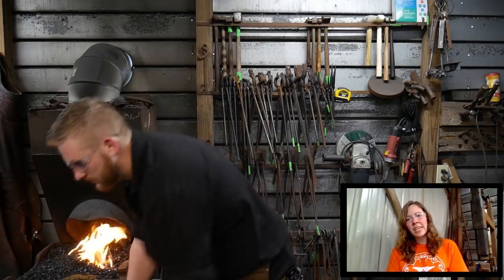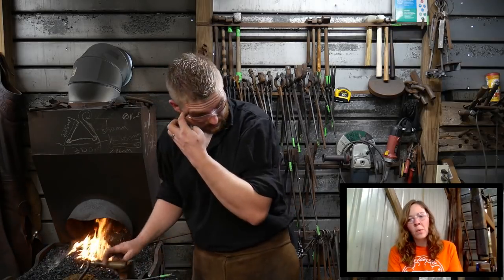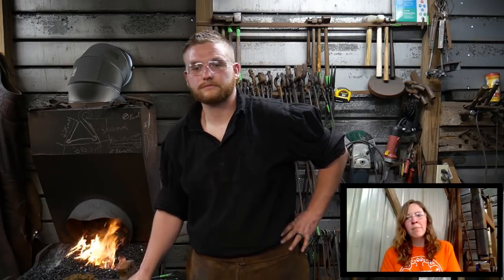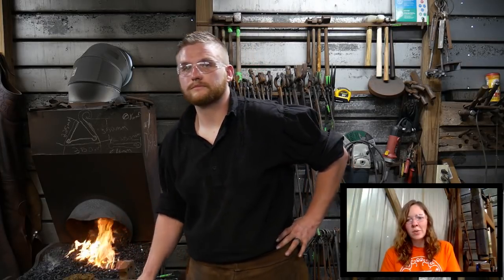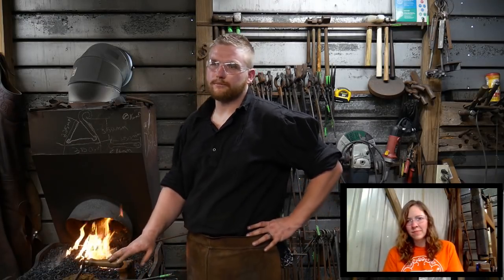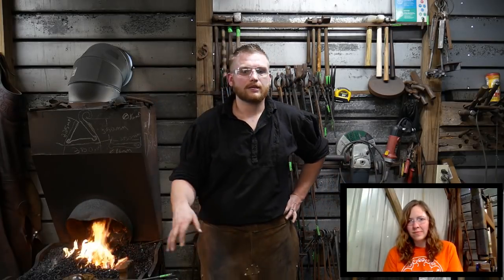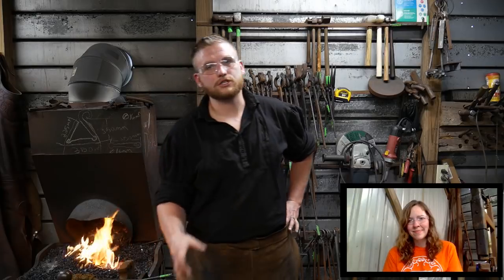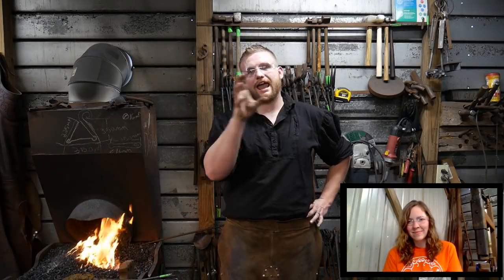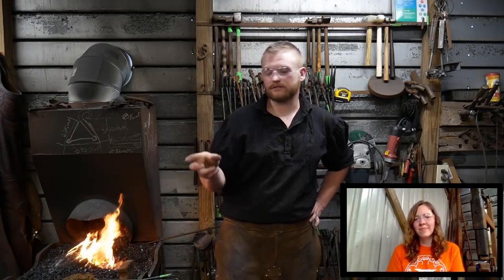Manga 12 says, oh, when heating with a torch, should I use a reducing flame or a neutral flame? I notice if I hit the welding part of the tip, it starts to cause the sparks to fly off instantly, but if I use the end of the flame, it's not heating quick enough. You'll want to use a neutral flame. There are certain times that you want to use a reducing flame, but if you're heating with a torch, you want neutral the best you can. And then you're going to have to pick the happy medium between those two. Not too close and not too far away.